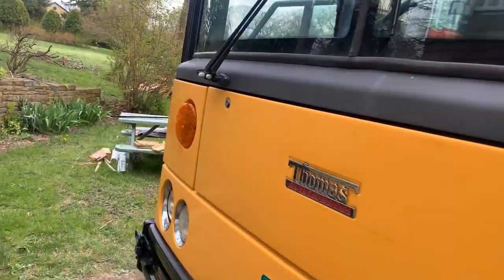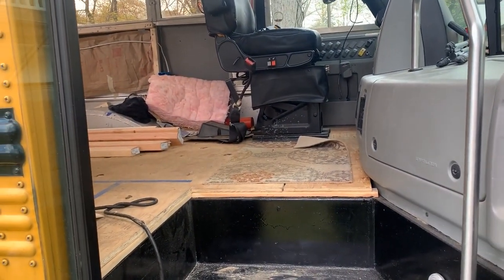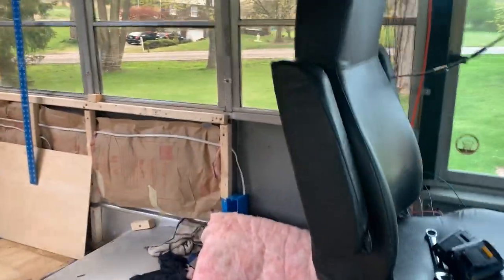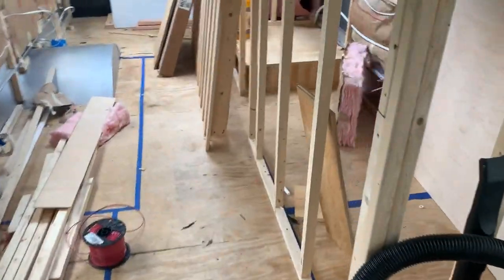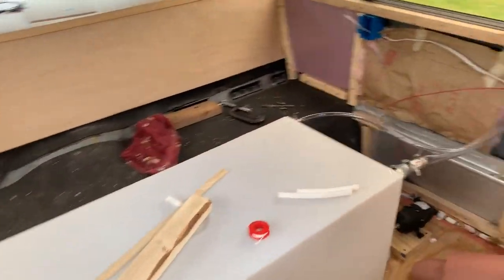When you're doing this, it's not like building a regular house. You can't say we're going to do all the framing, then all the insulation, then all the water, then all the electrical - it's one thing after another. Allison and I kept starting a project and saying 'wait, we have to do something else first.' We dug our feet in and put the shower pan in - it had to go there so we could get the plumbing down through there. That got us able to frame the wall in the way it's supposed to be, and then it was time for water.